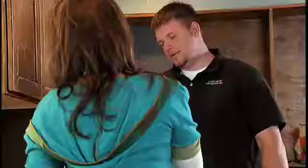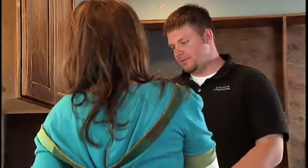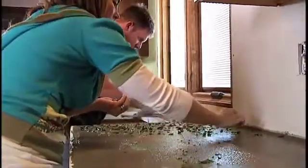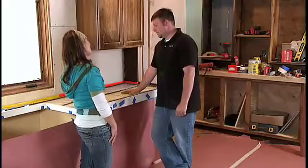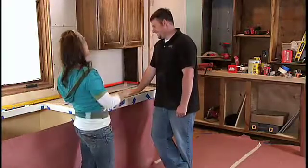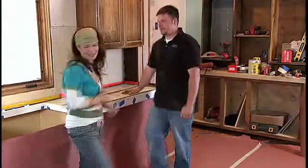And then for finishing it up, people have a lot of options when it comes to decorative finishes on their concrete. Yep, it's pretty much unlimited creativity. You can do integral color, you can do stains after the fact, and we're particularly embedding broken wine bottles in the top surface of this countertop, and then coming back and polishing it to expose the glass. So we probably won't see it once we get it poured, and it's just going to sit there. A few more steps along the way, right? Yep. All right, well, I think we're ready to get mixing. I'm ready to see it poured.